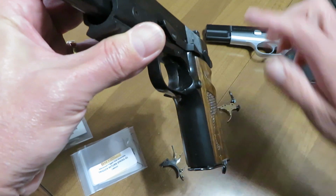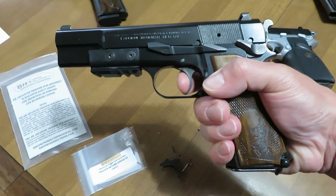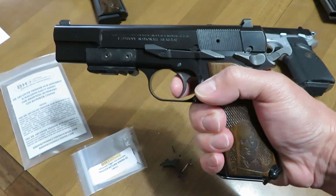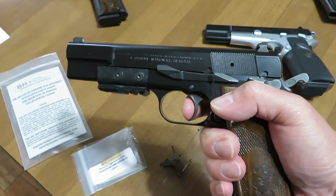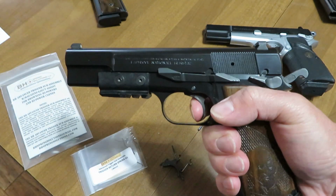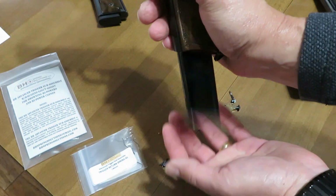The BH Spring Solutions trigger, along with being 9 millimeters wide, which is quite a difference to the finger, is gently rifle serrated, or competition rifle serrated. This is a very straight back trigger pull. It's also very silky smooth. It's also a short trigger pull. That is enabled by the fact that these trigger subassemblies all require a minor amount of fitting. And that makes possible a very short trigger pull, more Browning-esque, if you will, and a nice positive reset. We also have positive magazine eject assist.